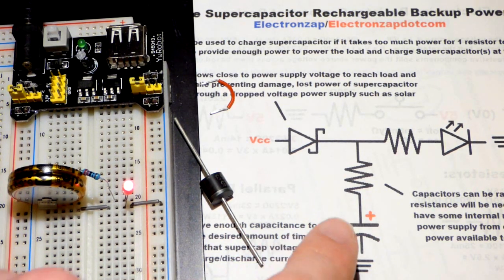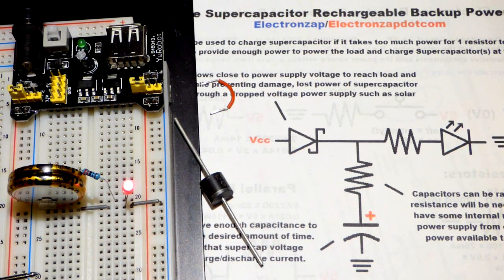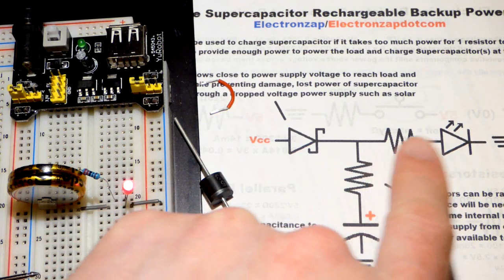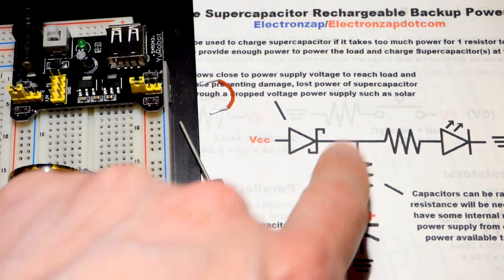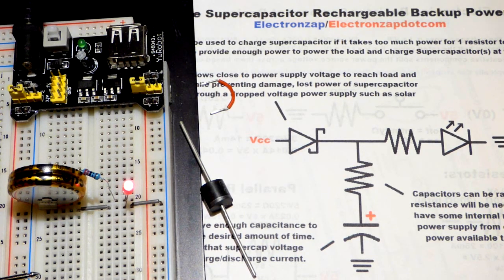With the bigger capacitors they take in a lot of current, and a single resistor to the power supply may not be able to provide that current without overheating. You can put other resistors in parallel with it — you just have to make sure this resistor can protect the load from the full power supply voltage. You can keep putting resistors in parallel so the super capacitor charges faster, and then this protective resistor will be working basically on its own for protecting the LED, which is fine because you can pick the value that is good enough for that. I'll go into that in other videos — hopefully you found this interesting. Thanks for watching.